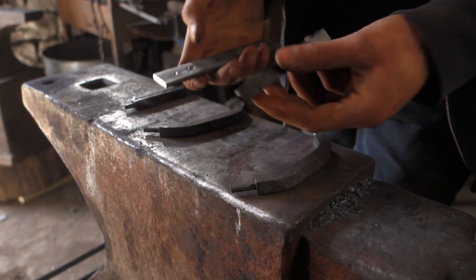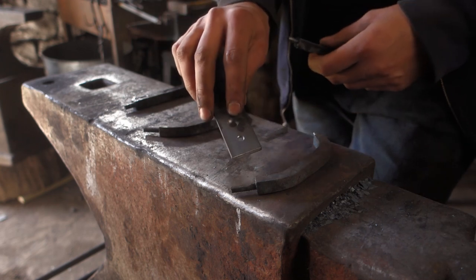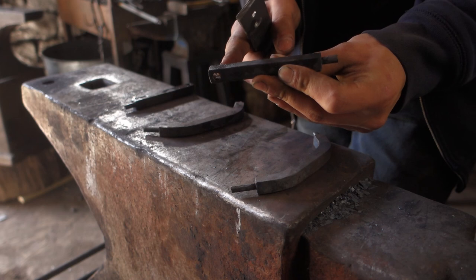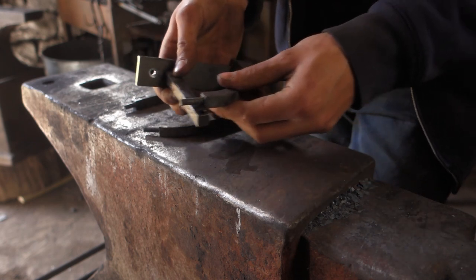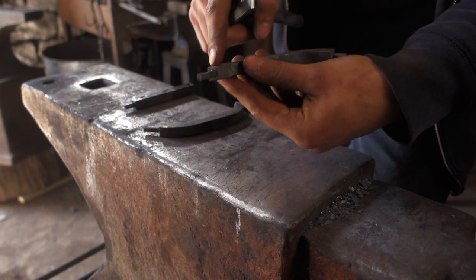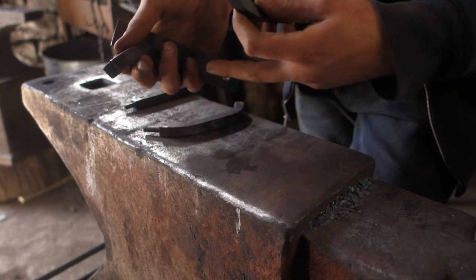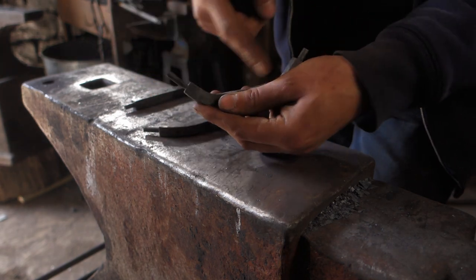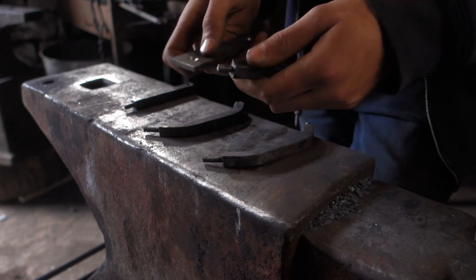Here are some of the other components — this is like the main bar coming out of the back plate, so that will go through that hole. It's a blind rivet, so it's got a countersunk hole; when we upset that it will create a nice flush backing to sit against the wall. This has a hole for the longer bar, and then we have this support piece that goes there. I need to drill the holes in the back plate and the arm, and you'll notice this piece has these weird bends — that's so the shoulder of the tenon is sitting perpendicular to the arm and back plate; if left straight they'd be at 45 degrees and wouldn't fit. I'll put some pieces in the fire and we can begin to assemble and rivet all the tenons over.